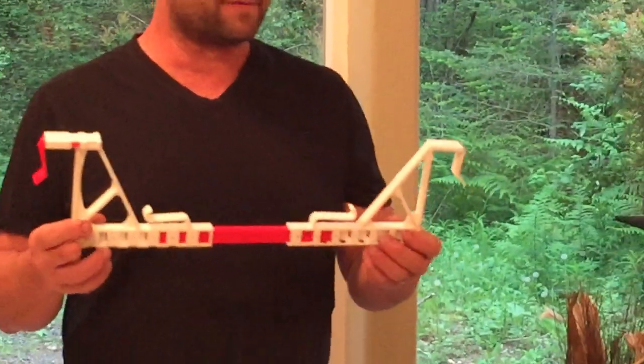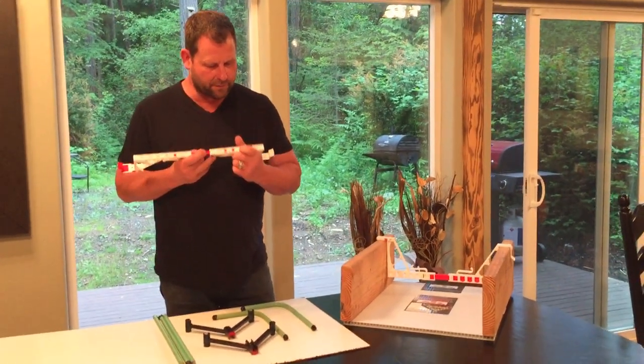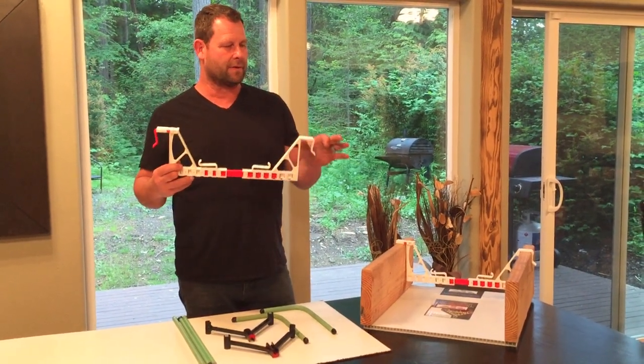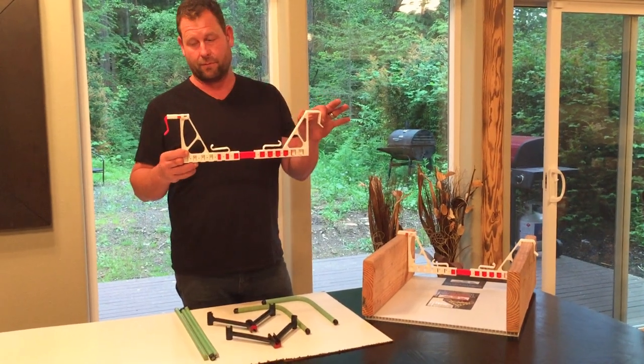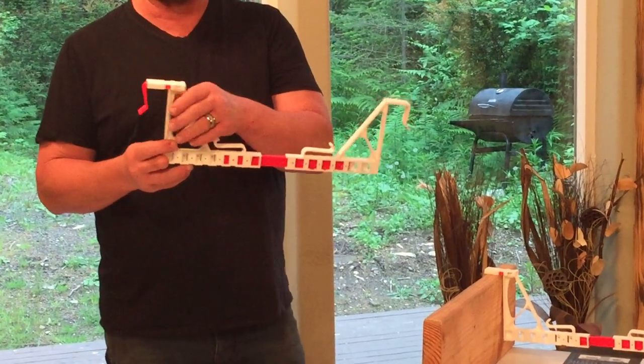We're doing a 16 inch footing, so I'm going to click it back in down to a 16 inch footing. We also have it available on a fixed end for three quarter or inch and a half forms, or an adjustable end, which is very convenient.